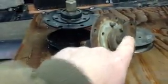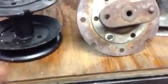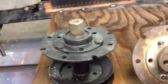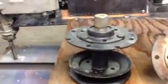What this part here is, right there is where the blades mount, and then this right here is the top side. The advantage to these is they're splined on the pulley, so they have good grip. And then they'll either get an aftermarket pulley like this one up here, and they'll drill holes and mount it, or they'll weld it, or they'll take one like this where he put this in the press, heated it up and pressed it off, and then get a pulley that has the same diameter. This is 1 inch. He'll slip it down over it, and then he'll tack weld it in place.